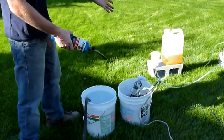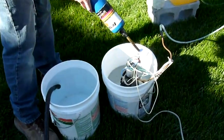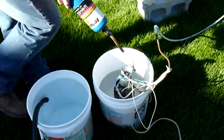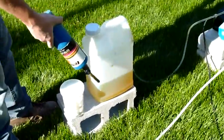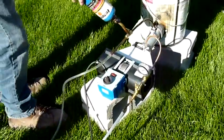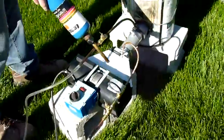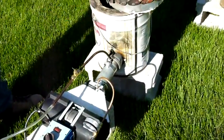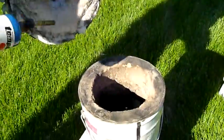As you can see, I have my whole setup hooked up right here. We have the compressor sitting in cooling water, the starting capacitor, the sock air filter, the air line, fuel jug, diesel fuel, and the fuel line which leads up to the fuel valve. We have the air bleed valve and the pressure gauge which I can control the air flow with, and of course this goes into the atomizer which shoots into the furnace.